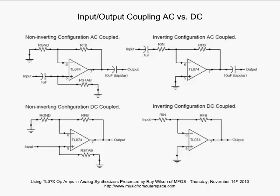If you don't have a bipolar capacitor handy in a value, take two electrolytic polarized capacitors of twice the value, put their negative poles together, and use the positive poles as the leads to your now 10 microfarad bipolar capacitor, or 11 microfarad if you use 22 microfarad capacitors.